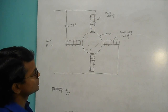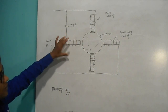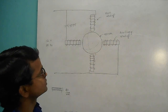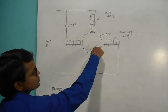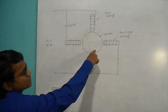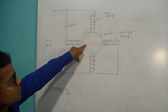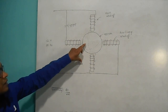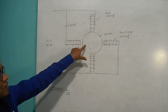This structure is your rotor. When supply is given to the stator, it creates a rotating magnetic field, and this magnetic field is linked with the rotor. According to Faraday's laws of electromagnetic induction, an EMF is induced in this rotor. This rotor is a conducting cage, so the induced EMF produces a current, and this current in the rotor develops another magnetic field.